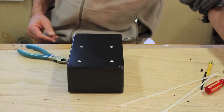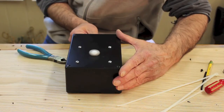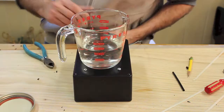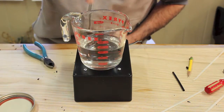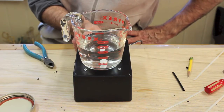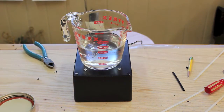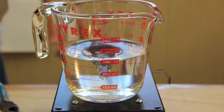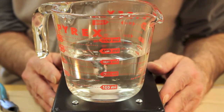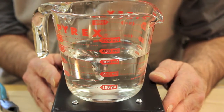Let's see how it works. Now let's try a real life experiment. I've got a little mixing vessel with some fluid in it. We'll drop in our little stir bar and see if we can stir. And there we go — we even got a little vortex funnel forming. So if you'd like to mix your shellac or any other finish automatically, this is a quick and easy to build magnetic stirrer for the wood shop.